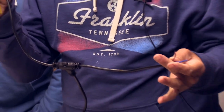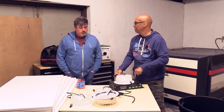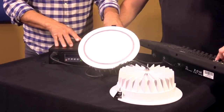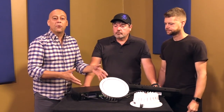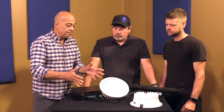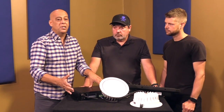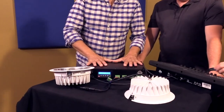Now, if this is the last light in your run, I'm going to explain it off each controller. Let me back up a little. This is your DMX 600. Yes, it does have a Meanwell power supply. Anybody who knows kind of electronics, Meanwell are your better power supplies. It still has a fan, they still make noise. You're not going to put this within the building itself. You'll put it in an electrical room, a utility closet, or a sound booth, but relatively quiet for what it's doing. And one fan, 16 lights instead of 16 lights with one fan each. Okay? This is all or nothing, folks.